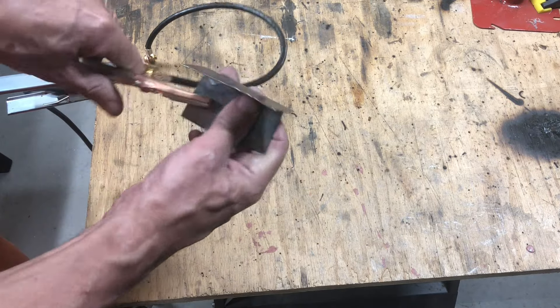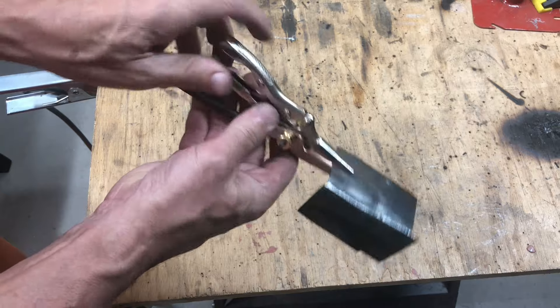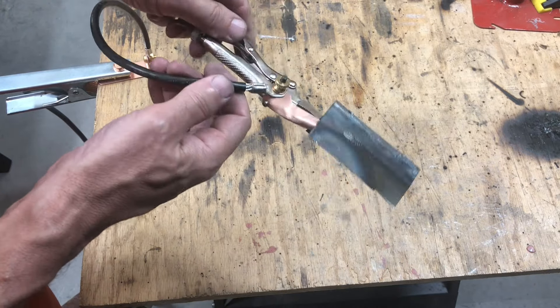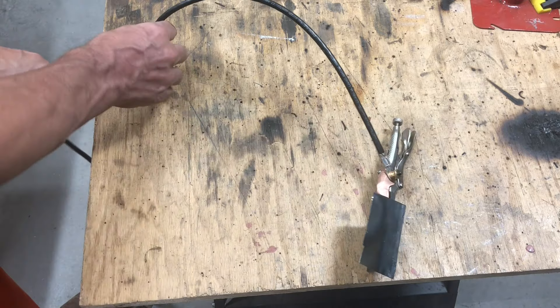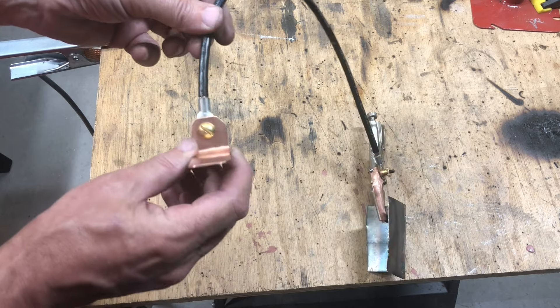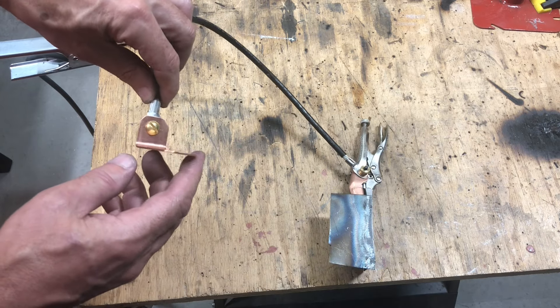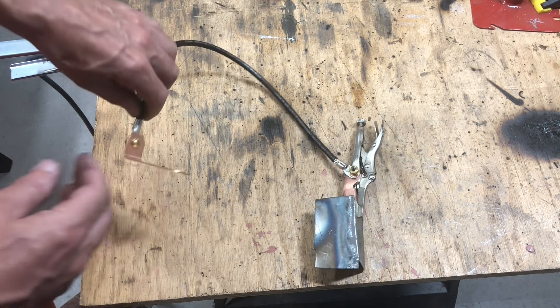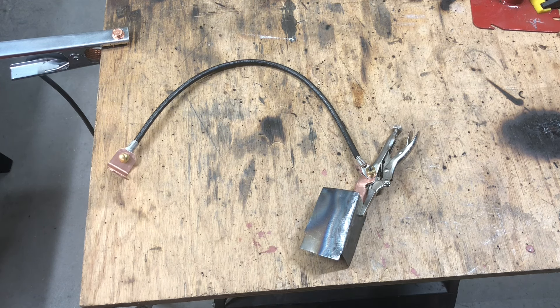The other advantage this has is this thumb screw is adjustable, so I can just loosen this up and reorient my cable, retighten my thumb screw, and maneuver this thing around any way I need to. Furthermore, this end is also adjustable — I just loosen up this screw and I can reorient the cable on this little bracket in case I need to get that into a tight spot. This will help a lot with welding inside cars, welding furniture when half of it's made out of wood, welding around anything that isn't conductive, or stuff where you just don't want to get your high dollar grounding clamp that close to the weld.